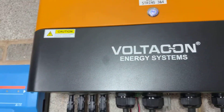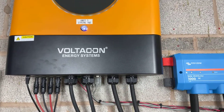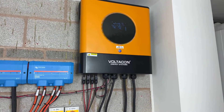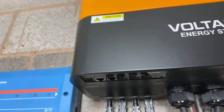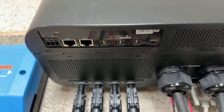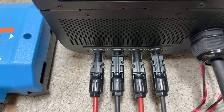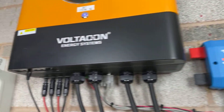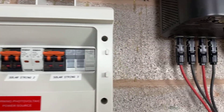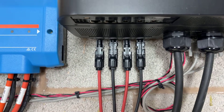The Wi-Fi is integrated — you can pair the inverters one at a time, and you have to pair both inverters with the Wi-Fi and create an account. These inverters also have auxiliary outputs at 12 volts — you may need them for external 12-volt loads, up to 8.4 amps total. Here we have our PV inputs: three strings to inverter one and one to inverter two, with a spare string not in use at the moment.